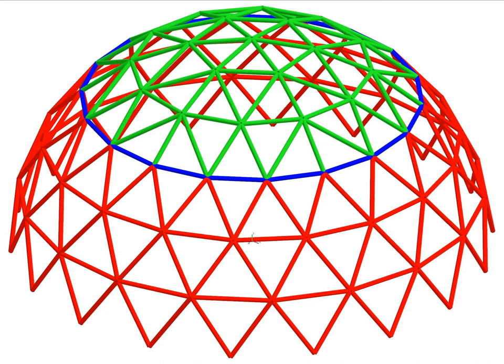What I'm going to use is Multiframe, and the reason I tend towards that is not only is it a pretty powerful and effective geometry generator, where I understand what the geometry is that's being generated, but it also allows us to do structural analysis after the fact. So we can take a dome like this and we can put loads on it and we can study the distribution of forces in the system.